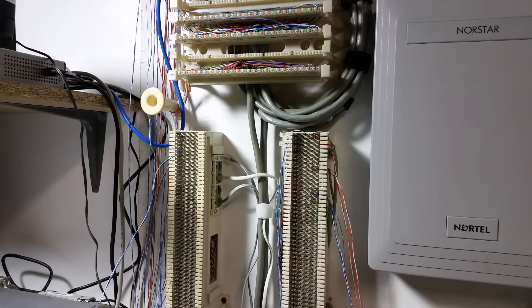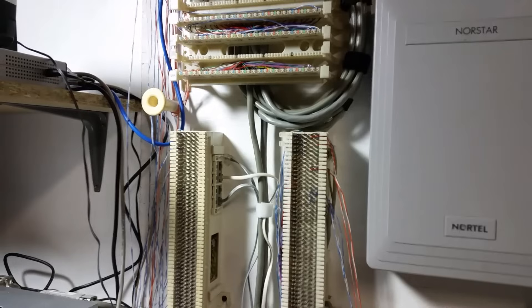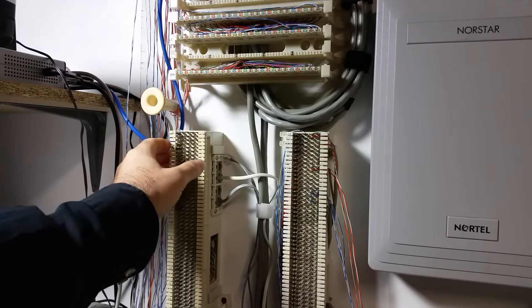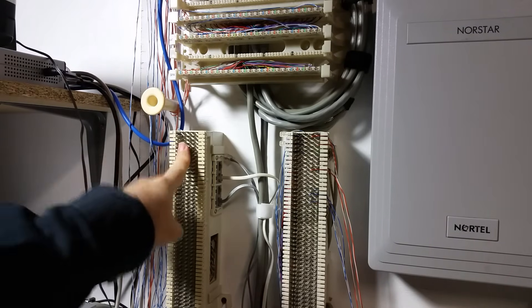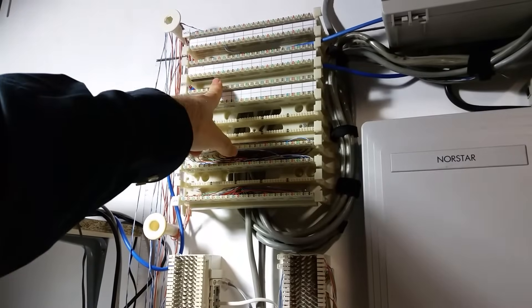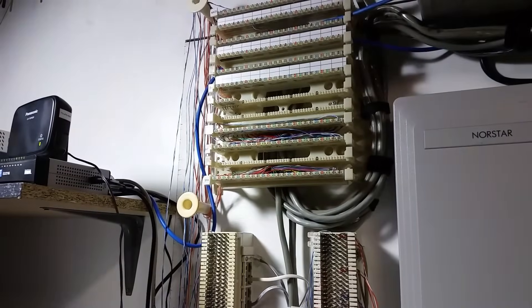So that is how the wall jack — say a telephone jack — makes its connection all the way back to the phone system. That telephone jack's wire usually terminates on what's known as station cabling or cabling distribution blocks in the phone room, and then the PBX technician makes that cross connect from the station cabling, usually on pair one or the white-blue pair, and puts it on the appropriate port of the PBX. These 110 blocks have 25-pair cables going into the PBX. I hope that helps you understand telephone cross connects — thanks for watching.